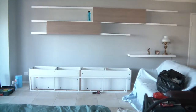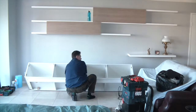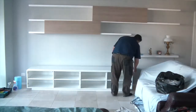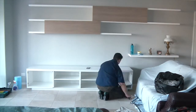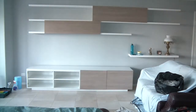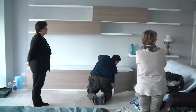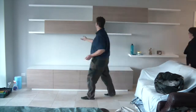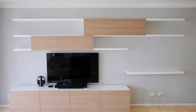Now I've got the base unit joined together and I'm putting the kickboard on — it all just falls into place and looks like one piece when it's done. The big bench top comes in, shelf pins go in, 16 screws to hold the bench top down, going back and forth to get the overhangs equal on both ends — about a half mill overhang each side. Now clicking the doors on. These doors were cut out of a single length so we've got continuity in the grain all the way across. The supplier got it wrong so they had to order a new sheet in from Belgium to make that happen. I've designed them to sit flush with the extents of the cabinet, and with an inset kickboard it kind of looks like it's floating. And here it is, all finished.